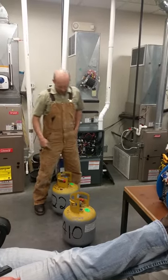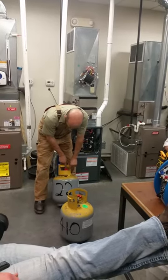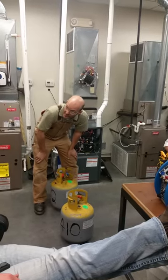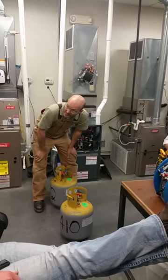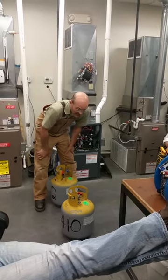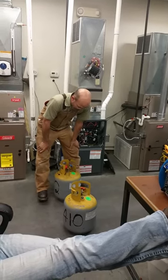We take the 47.7 and subtract the 28.2 from that — that tells us how much weight above the tare weight we have in this tank. So multiply by 0.8 — we just need to maintain that capacity for transportation. For service, we can put this on a scale and achieve full capacity.